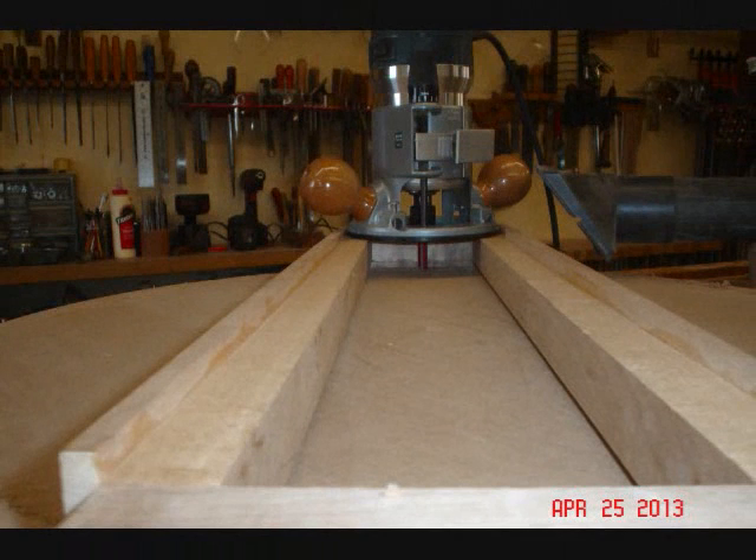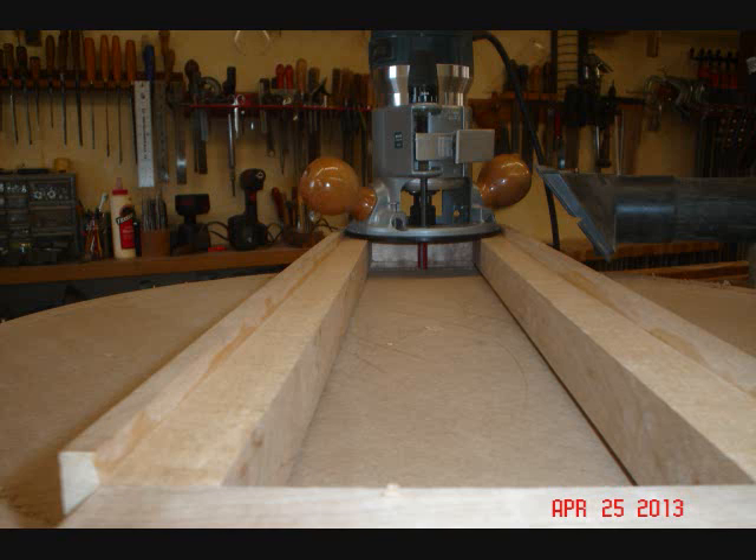Now that the disc is cut out, I've mounted that on the stage and I've mounted the frame over the stage, and you can see here the router is set up and ready to go. I've adjusted the router bit to take just barely a cut at the edge, and now I'm going to start the router and rotate the disc. Each time I've made a rotation I'm just going to move that router in another half an inch or so, make another rotation, and as it follows the concavity of that track it will repeat the exact same concavity in the disc. You'll be able to see that in our next video clip as well.